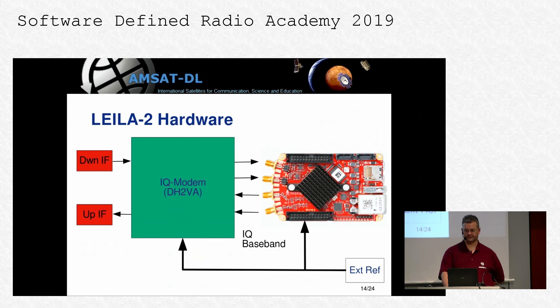Here is a view into the box — this is an early engineering model, not the final one. You can clearly see the Red Pitaya on the right-hand side. The PCB in the middle is this IQ modem from Achim. At the top is a display — a Raspberry Pi with an RTL-SDR style dongle just for a backup frequency display and user interface. The rest is up and down converters for traditional radios we had there also for testing, plus reference distribution and power supply to the left.